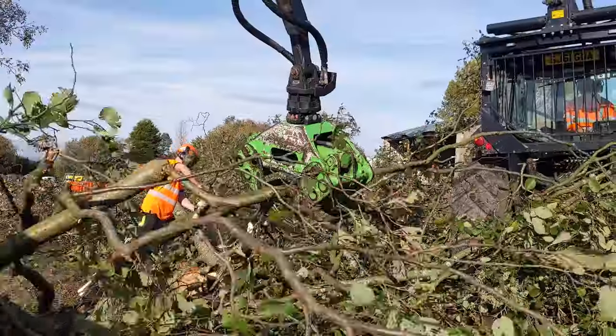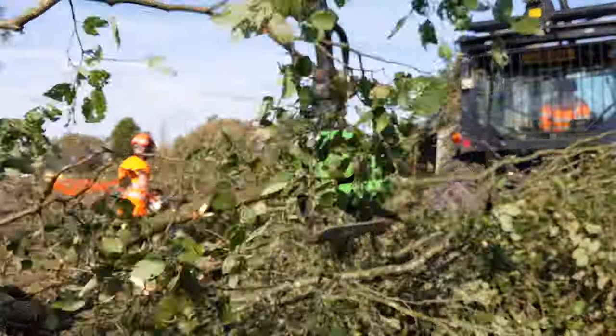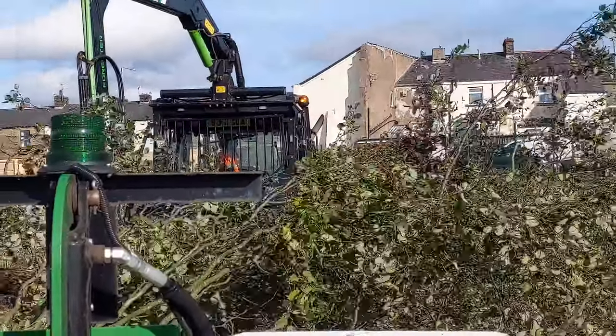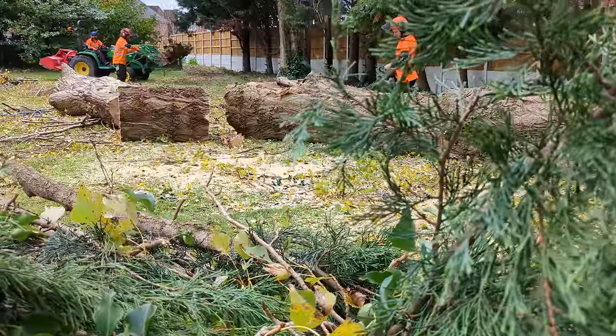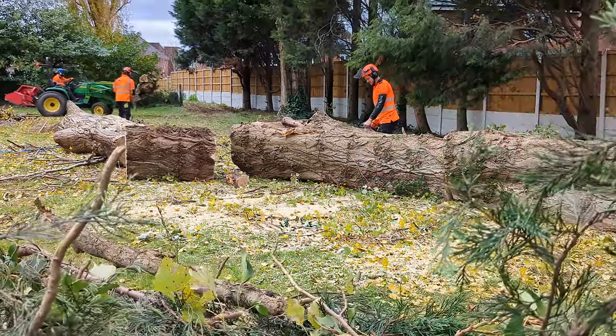For that situation, I think the Hexa is probably not the best choice — you're better off with a round file and a normal chain. What we found was that when we hit something with the Hexa, it was quite difficult to recover; you have to take a lot off the chain to get it back to where it was, whereas with a round file you can manipulate the tooth to get it to where you want it to be.